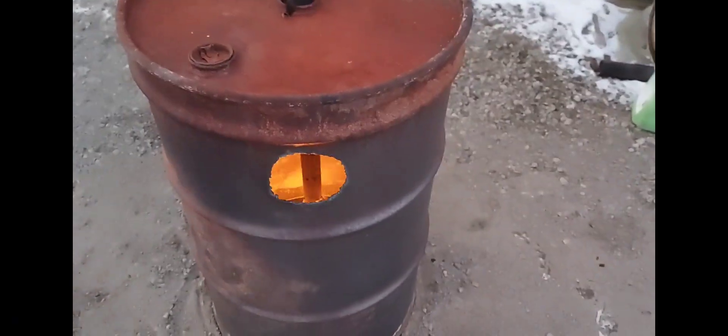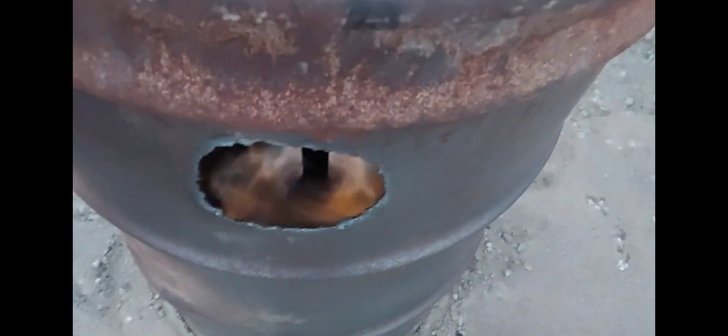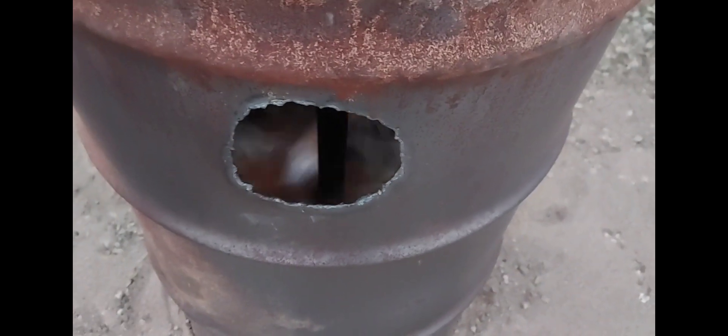She's taking a little while to get rolling. I'm just lighting it with oil and a few paper towels, so I'll bring you back when she gets rolling - should just be a couple minutes. We'll see if the improvements actually made any improvements. Of course, soon as I shut it off it started taking off. About five seconds later you can see it's starting to turn blue - pretty cool. That's the light-up process with cold oil at minus five Fahrenheit. You can see almost all the orange is gone now - a little bit lingering, but once it starts vaporizing that oil, all that orange will disappear. Should be pure blue.